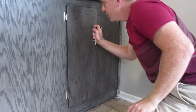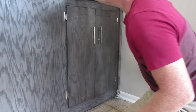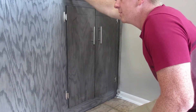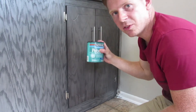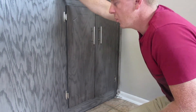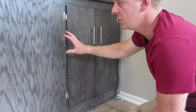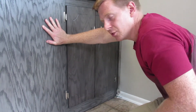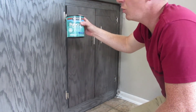My cabinets here are now finished. I went ahead and put some sealer on - I use the Minwax Polyacrylic. Be careful buying polyurethanes or any sealer, because oil-modified water-based sealers can yellow. If you put a couple coats on it can look like there's a yellow gloss. Not a big deal with a dark stain, but if you were doing a whitewash you would really notice the yellowing. That's why I use the Polyacrylic - I've used it many times on doors and it works great.